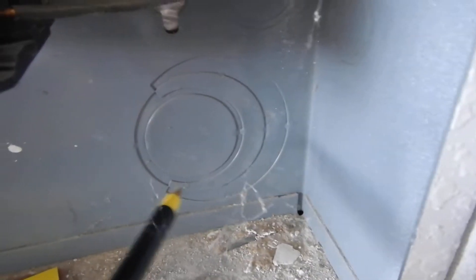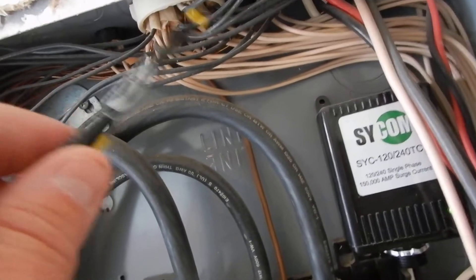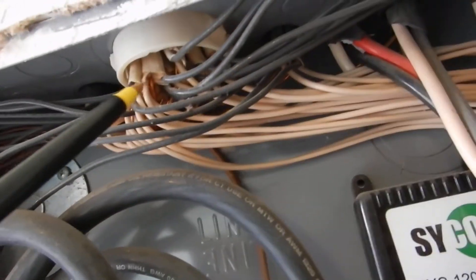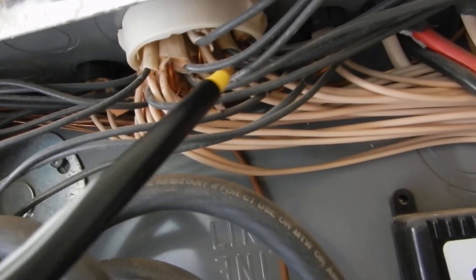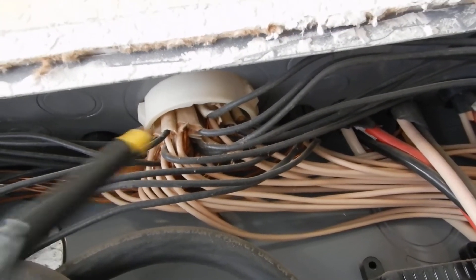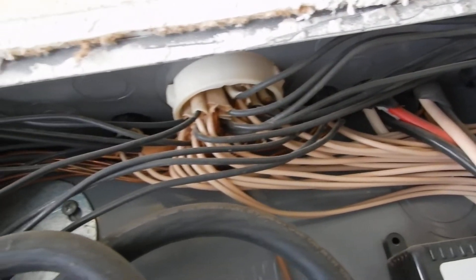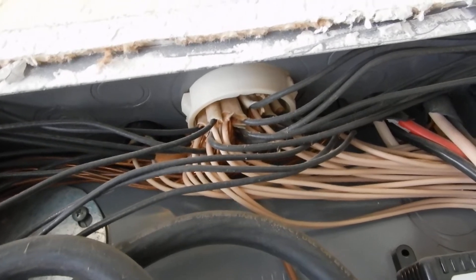The L1 and L2 come into the cabinet through these large knockouts. We installed several knockouts so the cabinet could go in just about any position. But somebody decided to knock out one of those big knockouts and bring all these small wires in through it — this is called bundling, and it's very common.